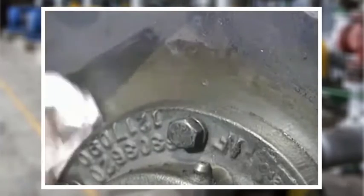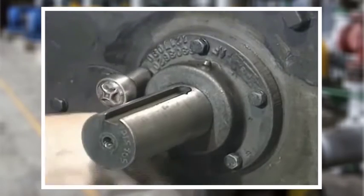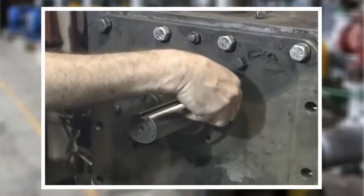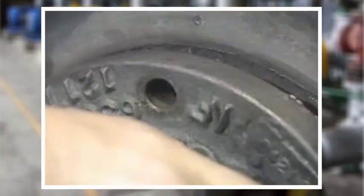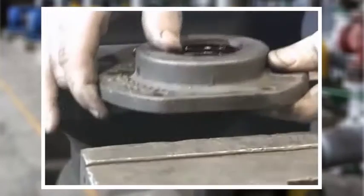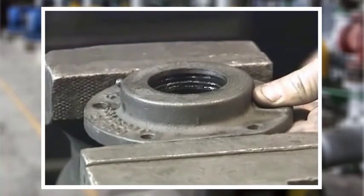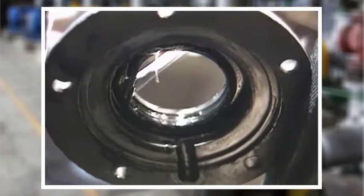This will help keep contaminants out of the reducer when the old seal is removed. Next, remove the seal cage assembly. Most seals have gaskets and these will have to be replaced with new ones. Check the manufacturer's specifications to make sure you know which ones to use — they will have to be the same size and shape and of a specific thickness as well. Work carefully; if the seal cage is damaged in the process, it will have to be replaced. Do not attempt to reuse a seal cage that is bent, distorted, or scored.